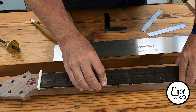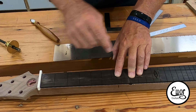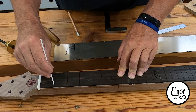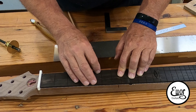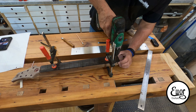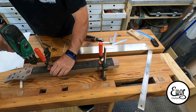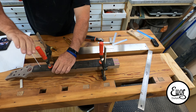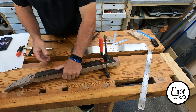I'll set it in place based on nut width, and that fit is really nice up against the nut, which is also tight against the headstock. I'm going to drill in a couple of little indexing pins — I'll use my side dot fret marking material, which is a 3/32nds-of-an-inch PVC rod. It'll fit right under the fret on either side. That 3/32nds diameter will get completely covered by the fret, and it's really easy to work with, so I like using those for little indexing pins on a fretboard.